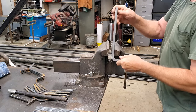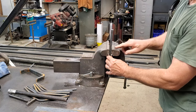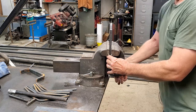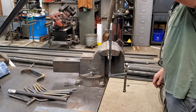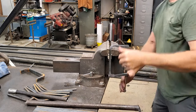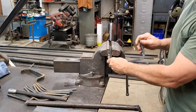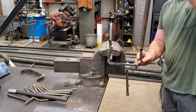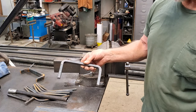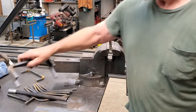If I bent this one on the line it would be shorter, so I raise up a half inch because I'm bending half-inch bar stock. Grab it like that, just a little bit, drop your weight down. If it's crooked, you can bring it back and drop down again. Look at that — you can't beat that. That's a good handle; I'll cut off what I need.